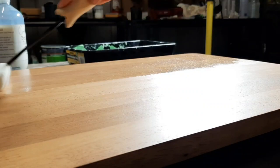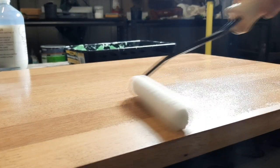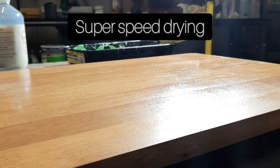So I ended up applying 3 or 4 coats of Cuts & Millie Satin Top Coat. I sanded with 400 grit sandpaper in between to get that baby bum smooth finish. And the combination between the Cuts & Millie Satin Top Coat and the two Fussy Blokes rollers is a match made in heaven. It is absolutely fantastic.